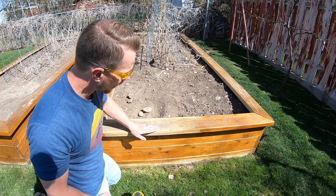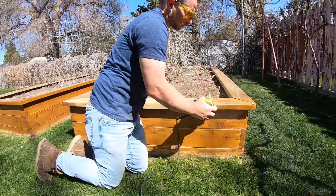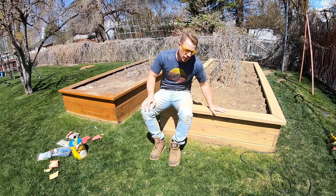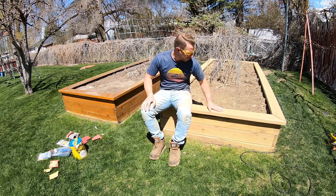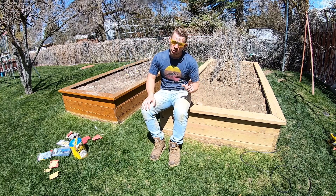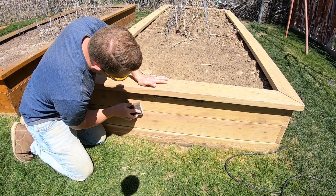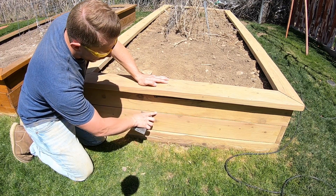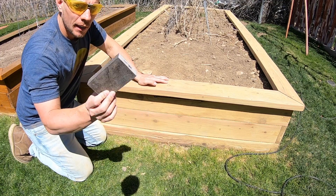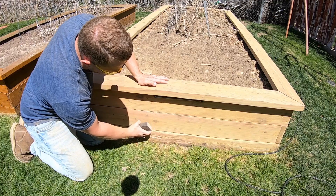These don't have to look perfect, but I really do want to take a good layer off so that they turn out nice. This bench is completely sanded and you can tell it is a light tone — we've taken it down to the raw wood. This top part had a lot of peeling so I had to sand it down more than I wanted to, but this part wasn't really peeling so I just did a light sand to get it prepped and ready. I recommend getting a foam pad sander, putting the corner in, and just hitting those crevices lightly so that when you stain the whole thing again it'll all absorb evenly.